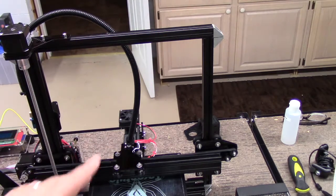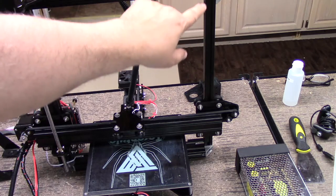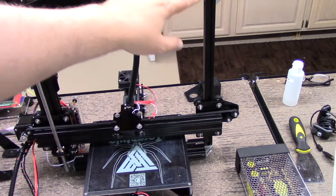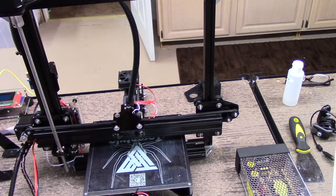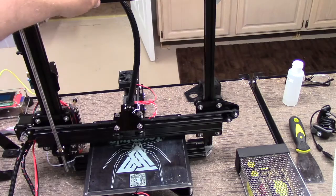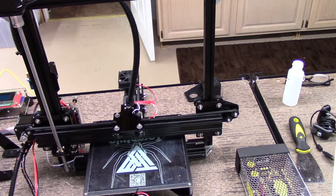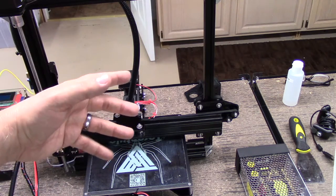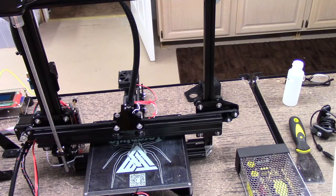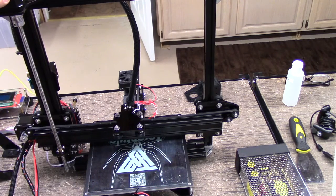One thing I am going to build is some outriggers. To make this all square, I took a machinist square in all four corners, so the gantry is perfectly square. But because the length of the two uprights don't match — they're like a millimeter or two off — it doesn't sit level on the table. You can kind of see this wobble. That's because the pieces at the bottom aren't level. So I'm going to design something that provides some lift off the side with feet to level it out and eliminate the wobble.